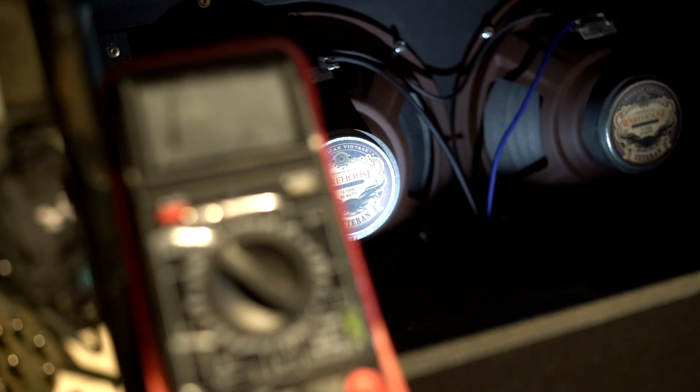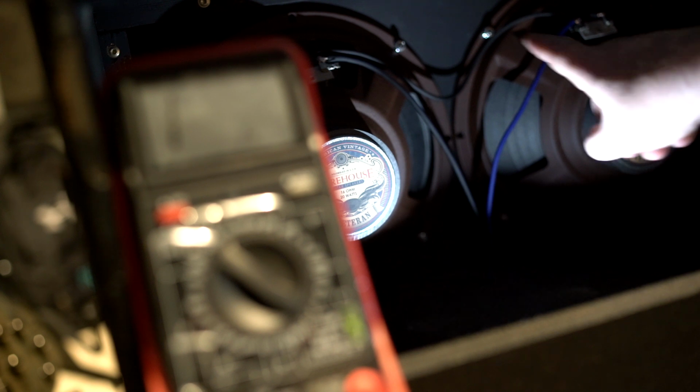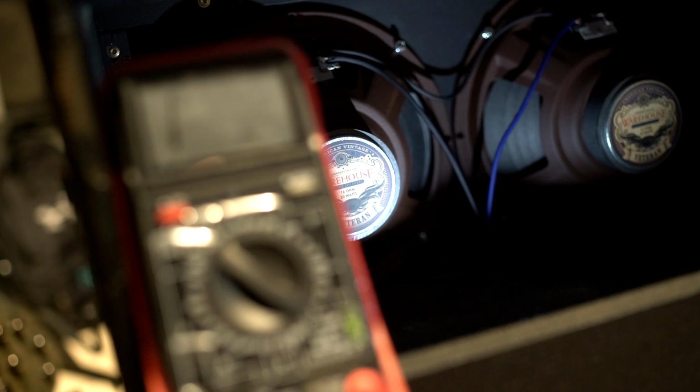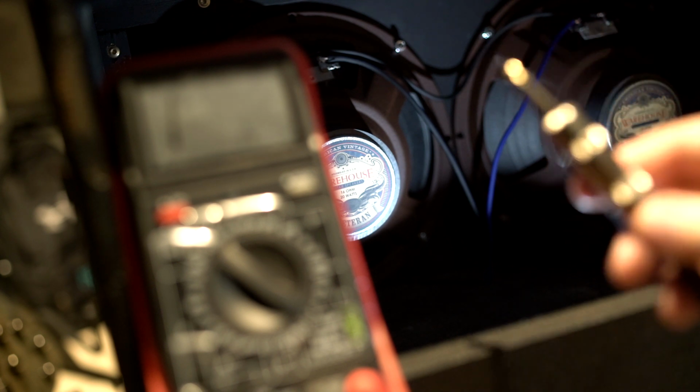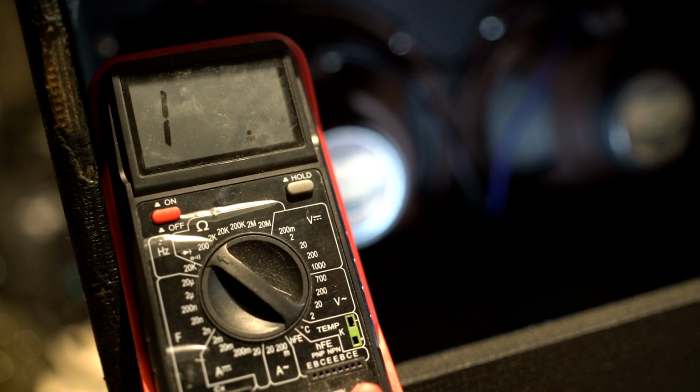All right, I've got my top level speakers wired. I have my positive going to my positive of this speaker, the negative of this going to the positive of this, and then the negative of this going back to my jack. Now I currently have a cable plugged into the jack, and I've got my multimeter hooked up. So after doing some calculations, it should be around 12, 13 ohm rating, I hope-ish. Okay, now 12.3, 12.2,